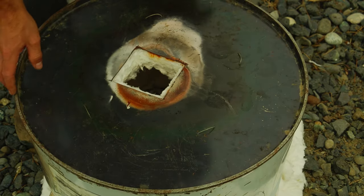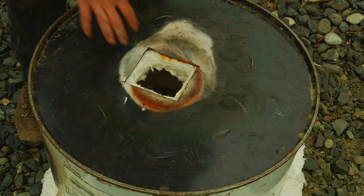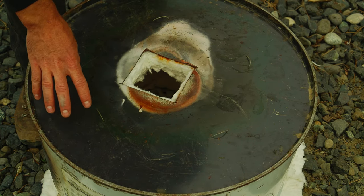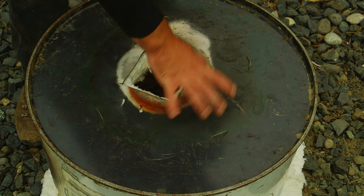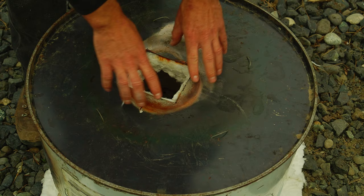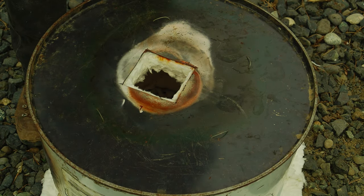This is something else I would change about this design. There's a bit of a cold spot in the center of the kiln, so pieces near the center tend to have cold spots on those sides. I would try something that Simon Leach suggests: putting the flue right next to the burner so that when your burner is sending heat in, it has to travel all the way around before coming back out again — that might reduce the cold spot. Another possible way is to build up a kind of chimney using bricks or anything to elevate this, which will help keep a little more heat down in the kiln.